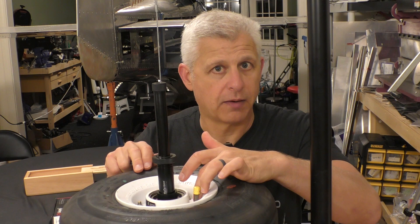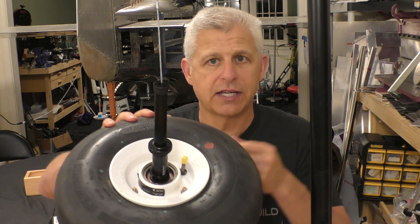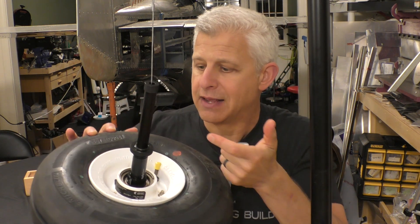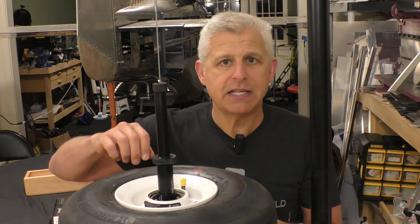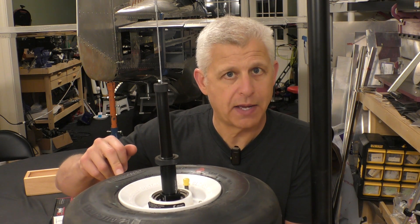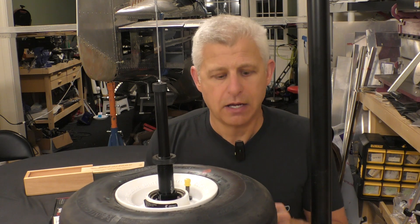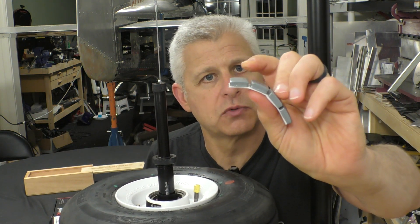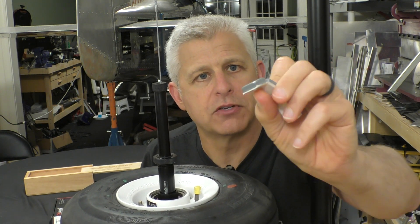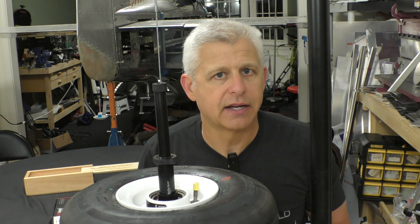With a very small space to work from — maybe two to two-and-a-half inches between where weights can be mounted and the center of the shaft — that's not much of a moment arm. It might need very little weight at the tire edge but much more weight close to the center. You're going to want to look for weights that are fairly tall. These are half-ounce square weights, available on Amazon. You generally want more weight and height. You can cut them down if needed, but half-ounce weights in a square form are generally going to do a good job.